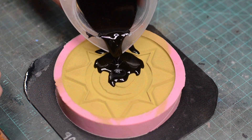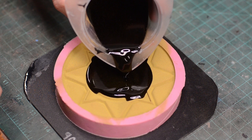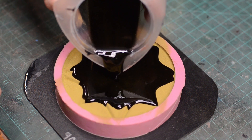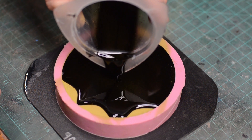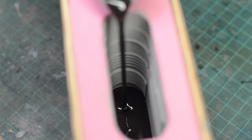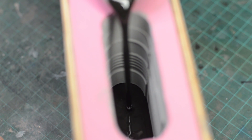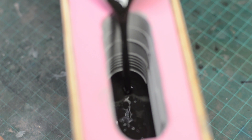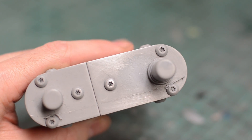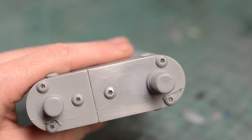You do have to be kind of careful here. If you just dump it in willy-nilly, you can displace some of that powder, creating a spot that doesn't have any coverage. I like to pour slowly and gently over the surface of my mold. If there's any area where it doesn't matter if the finish gets displaced, pour it there — especially if you're pouring into a really deep mold, because that resin is going to fall and hit the bottom surface and the splattering motion will displace a whole bunch of that metallic powder. I also don't like to pour resin down the side of a deep mold because it will pull the powder off on its way down. The best place is just bombs away — hit a spot you don't care about.